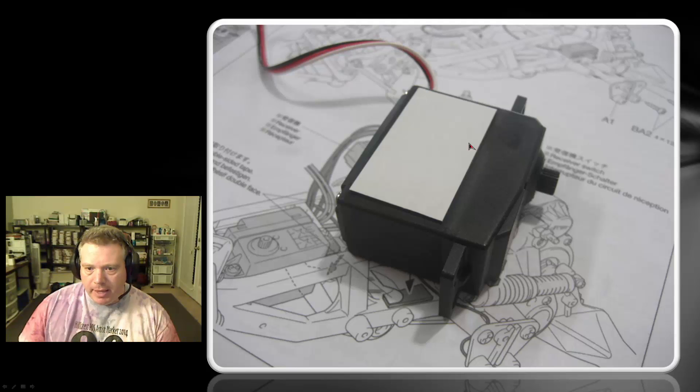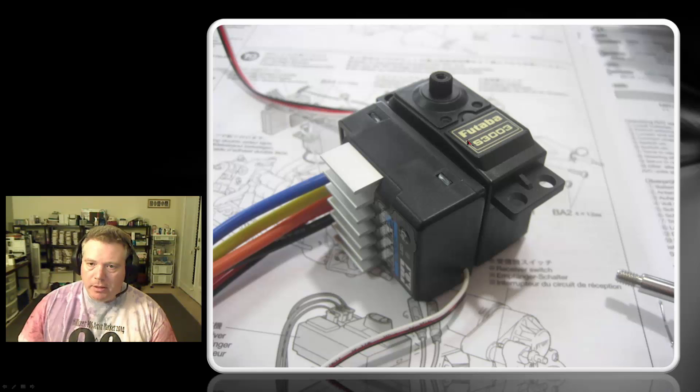What I did was I aligned it up so that if you look carefully, you can see that this one had a crease in the plastic where it was molded. So I put it on the edge of that crease, which gave the rollover edge breathing room, and I took an exacto knife and cut a tiny little notch in the tape — not all the way through the foam, but just in the top part — so I knew where to cut. That gave me a piece just slightly shorter than the width of my servo. Then I put the servo standing up straight like so and put the speed control up against it on the table so that the bottoms were flush. I also ensured that the front edge was flush because of the way this mounts into the car. I believe those two things are the most important. Then you just push them together.